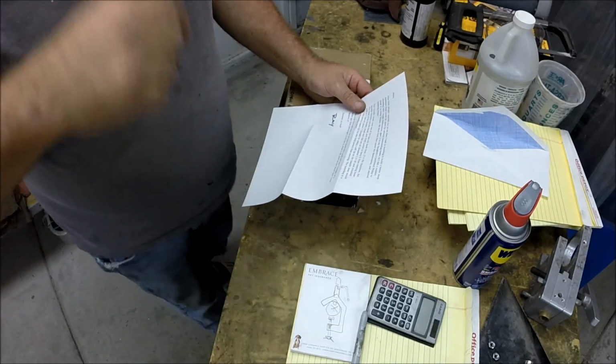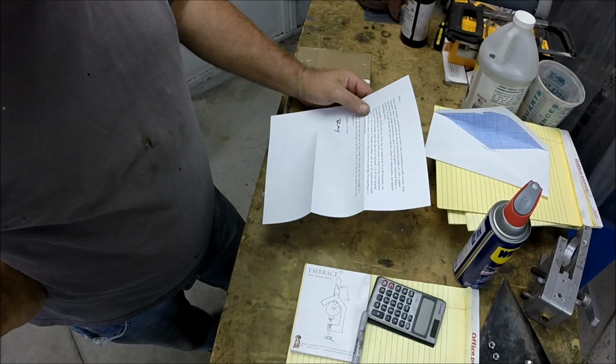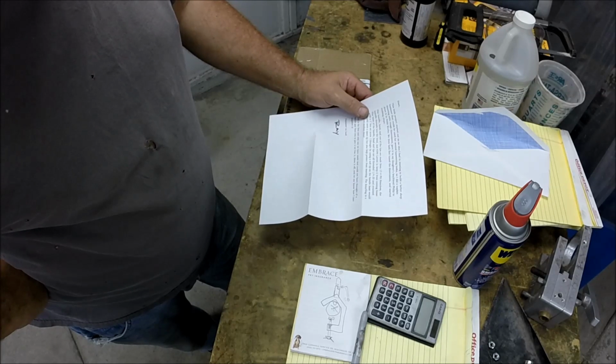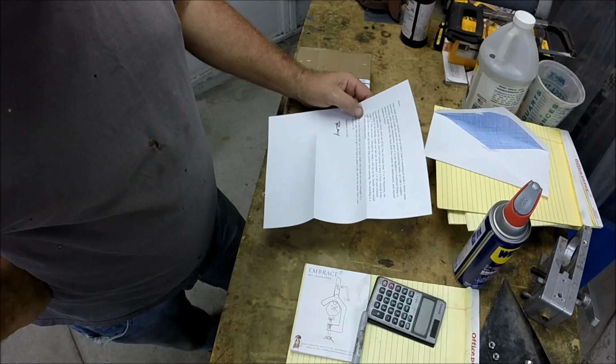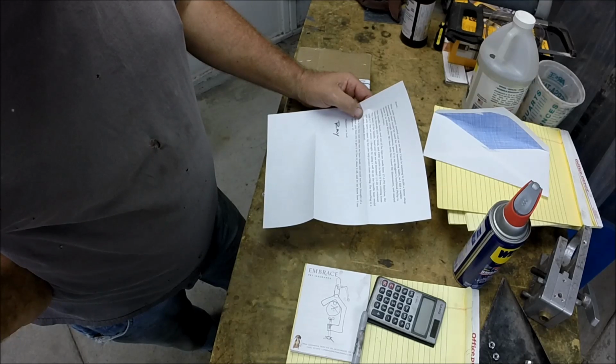Stan, this little project started out as an idea I had in wanting to build a better shop hammer that could be used for several hammering tasks. So I did a napkin drawing with rough dimensions, gave it to my daughter's boyfriend, Philip, to draw it in SolidWorks. Then we both fine-tuned the dimensions and started making chips. The handle, head, and one of the tips are made from 17-4 PH stainless. The handle threads into the head with 290 Loctite to keep it from coming loose. The base of the handle, head, and tips are all threaded quarter-20 and retained with a 1/8-inch hex set screw. I thought by using the soft tip on the handle base, it would not only serve as a spare tip, but it helped protect it from marring.